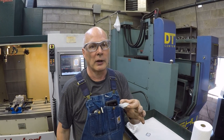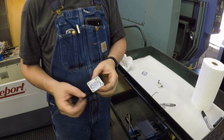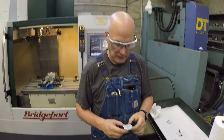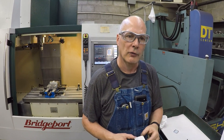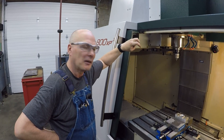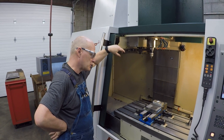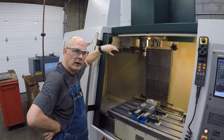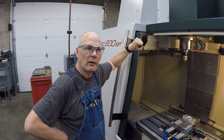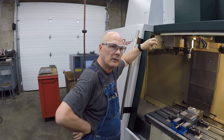If you machine an island to fit the part and put it around this way with clamps here, you're still clamping where it's thick. Whereas if you hold it in a vise, you'd better have some kind of pressure control or you'll warp it. This is one thing you can keep in the back of your mind when doing something thin. If you have to machine the outside and don't have any holes in it, you'll machine part of it, then the other part — and you might go to tape or glue, which is a better alternative than vacuum because vacuum can be expensive.